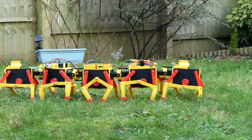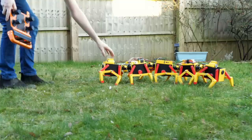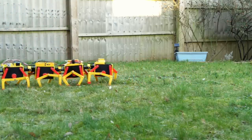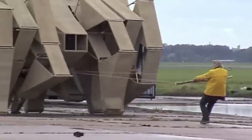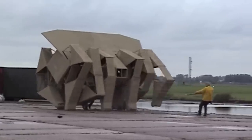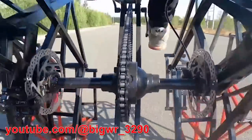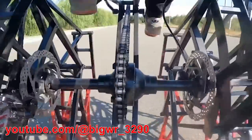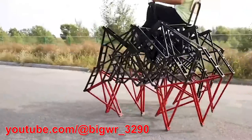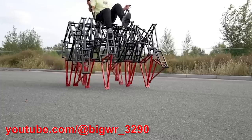Let's try it on a grippier surface — but on grass it's really struggling, the motors are really labouring and it only really works if I grab it and help pull it along. A better mechanism for this might be the Strandbeest mechanism, which has slightly more complicated linkages but the feet move back in a much more consistent linear fashion so they don't jam against each other. Several people have made ride-on versions of Strandbeests and versions with legs pushing bicycles, and there don't seem to be too many problems with the legs moving out of sync — so this would probably be a much better mechanism for a centipede with lots of Strandbeests all walking in a line.